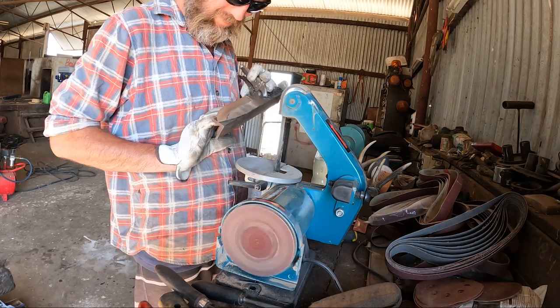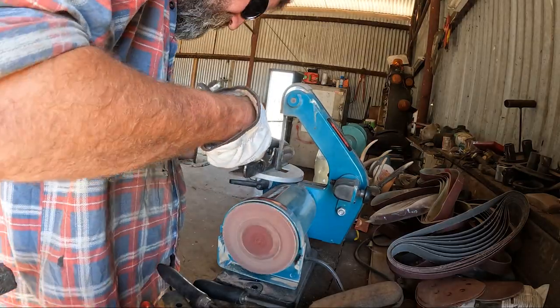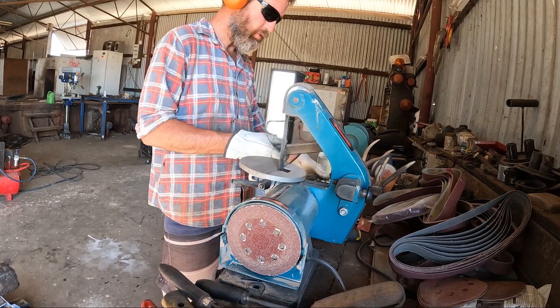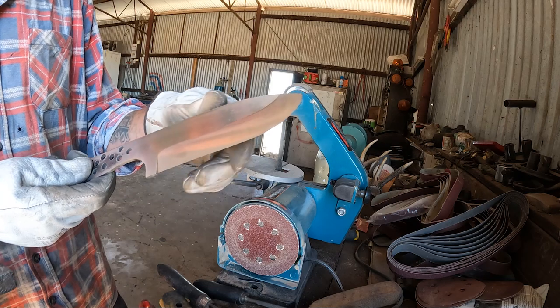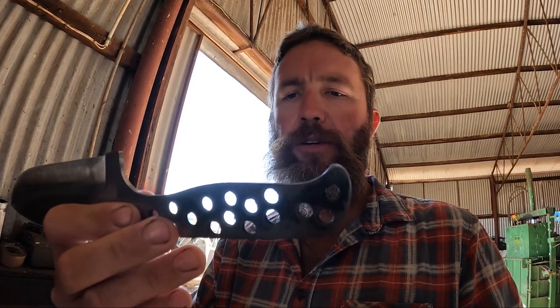This is the part I usually stuff up — I'm not too skilled in this process but I'll give it a crack. It's hit and miss, 50-50. This knife now has pretty much finished sanding. I've just got to clean all the handle up in amongst these holes here, clean it all out with a bit of alcohol wipes, make sure there's no grit. Then I've got some two-part epoxy glue — pretty much like an Araldite. I'll tape up the blade so I don't get any glue on it, then glue the handle and clamp it together for a couple of days. After that, a final sand on the handle and then an oil — I just use tung oil usually.